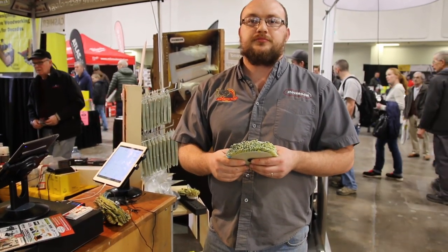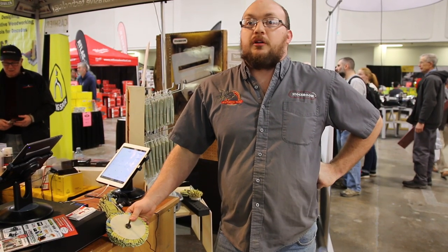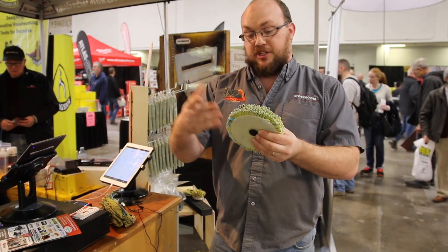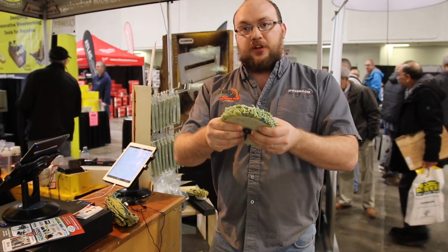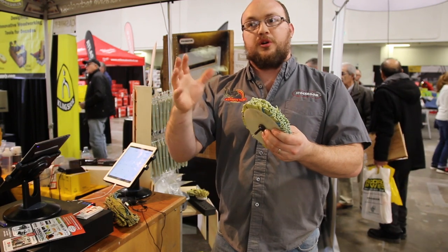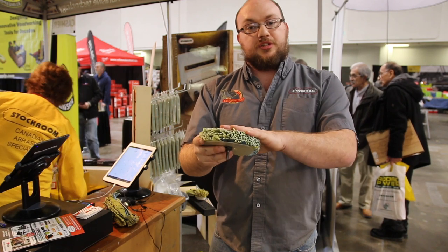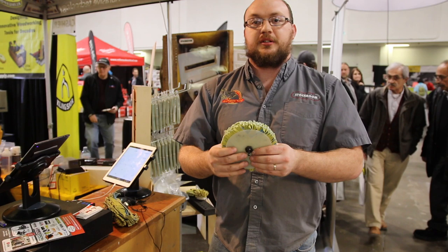So I guess that would be good if you want to refinish a chair spindle or something like that. For sure, yeah. So if you already have a finish on the material, what a lot of guys do, I've actually made a YouTube video on it, is removing the finish from anything that's got a profile on it can be a pain. Where if you use a finish remover, let it dry and crystallize, and then use a sanding mop on top of it, it makes removing finishes really, really easy.